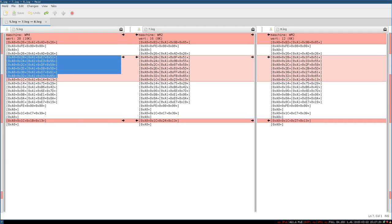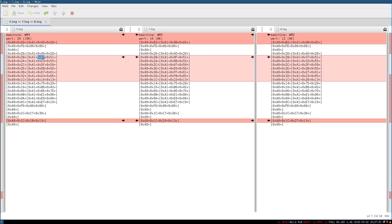If we look at one block, you will see something a bit curious. The first byte is decremented by 4, and this continues on. Decrement by 4, decrement by 4, decrement by 4, and so on. The second byte is incremented by 4 when you increment the address. Here we see increment by 4, increment by 4, increment by 4. So what is only important is this first value. The other values are just increments or decrements of this value.